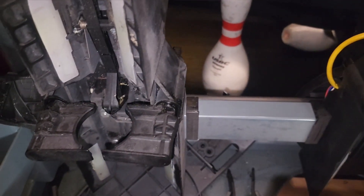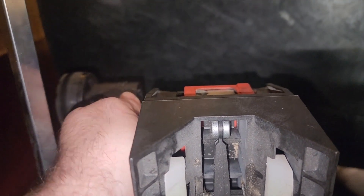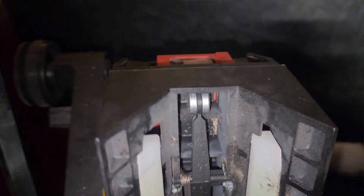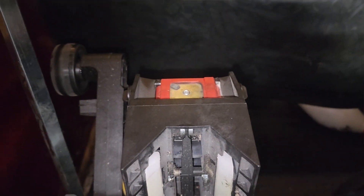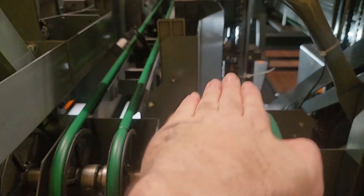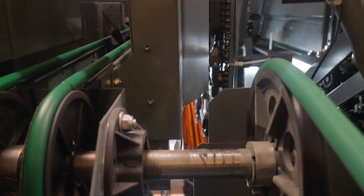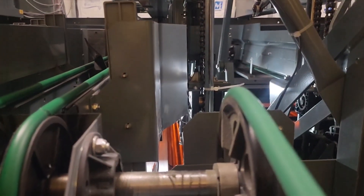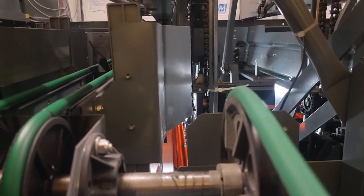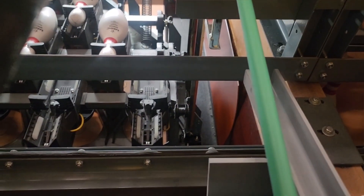All we've got to do is put our pin detecting plate back on and we're done. I dropped the other pivot pin and couldn't find it anywhere — had to run back to the workshop to grab that one, but we're good to go. Let's fire it up. Ultimately what was happening is that pins were double loading in the pin holder for seven, coming up and smooshing the side frame here, bending it out. We got it bent back pretty straight. The question is why did the part get bent? We had a problem with the pin holder — so we fix the issue, and then we fix the real issue.